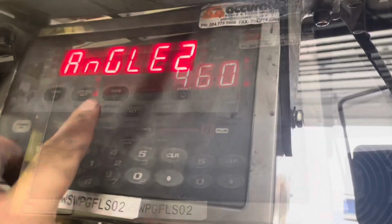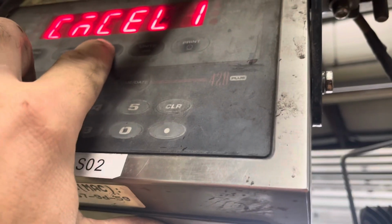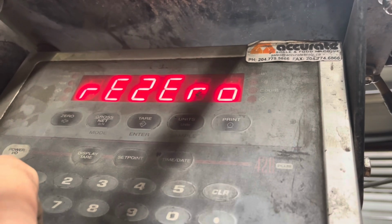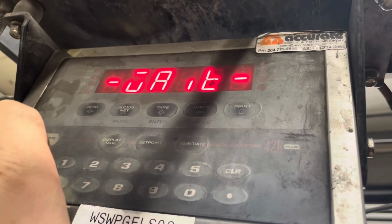So I threw my certified weights on the scale, I zeroed everything, and I got 460. So right then I know the customer's weight is incorrect. I'll go through that whole process again, level everything, zero everything, put my weights on, and you have to calibrate this to the left fork, so the driver side fork number 1, and then the second fork would be the passenger side, fork number 2. That's the appropriate way you actually calibrate these forks properly. So 441 pounds or 200 kgs switched over, you calibrate that, and then boom, your forks are accurate.